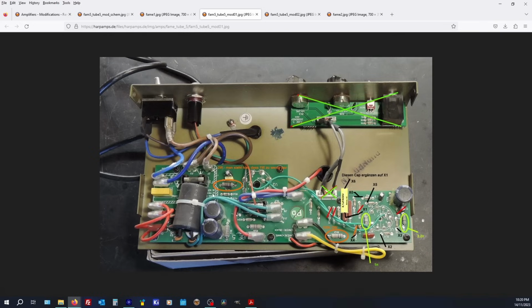So yeah, apparently it had a 1 watt previously. That looks like a pretty large 1 watt resistor though, but point being, that's been replaced. They put a 3 watt in its place. I recognize those resistors because I've got them in stock. Having said that, no, the cap exploded, so it definitely had a failed valve, and that's why you've got the JJs in there. Sorry, I just like to triply confirm everything that I'm saying in my own head.